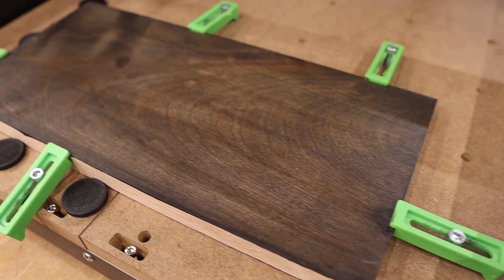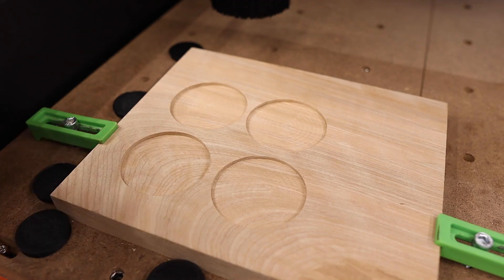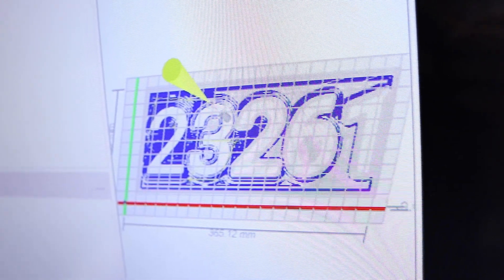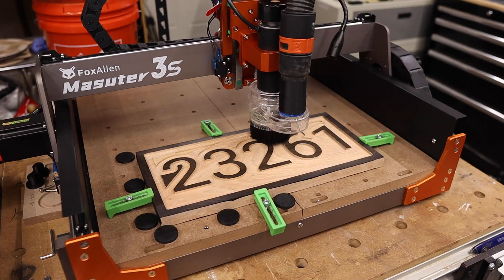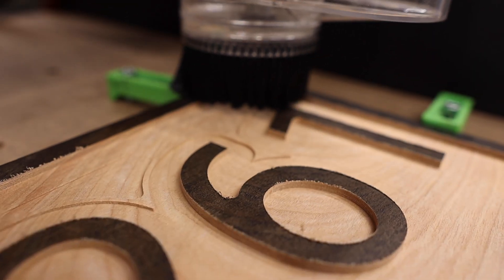For this project, I'm using three quarter inch solid birch which I've stained black, and my tool is a quarter inch compression end mill. I ran some quick pocketing toolpaths in order to test fit an inlaid branding medallion, and after a few tries I got the fit perfect. I'm running this pocket toolpath at 40 inches per minute at a depth of cut of 0.03 inches. I'm also ramping into the cuts at 20 degrees to help minimize the stress on the bit and the spindle. The most important thing I'm going for here is quality of cut — a little extra time in the toolpath will save a bunch of tedious sanding.